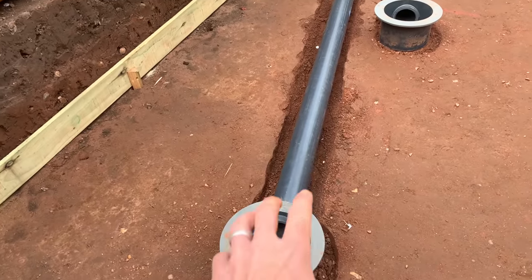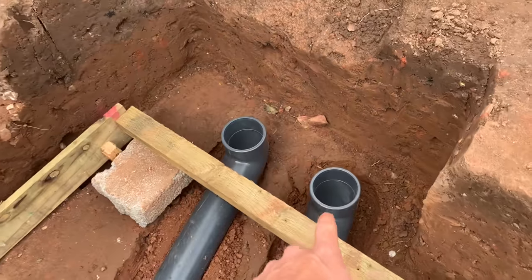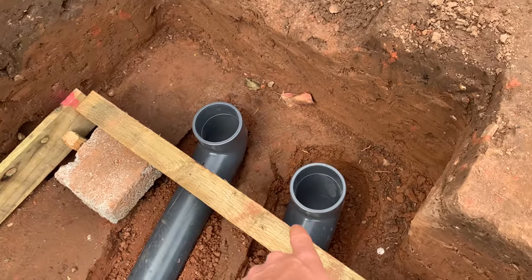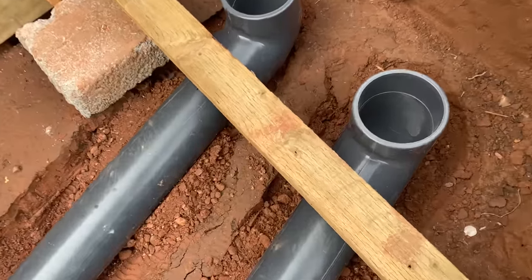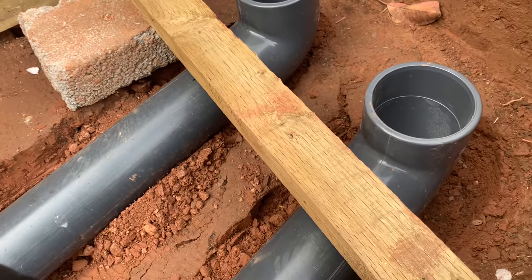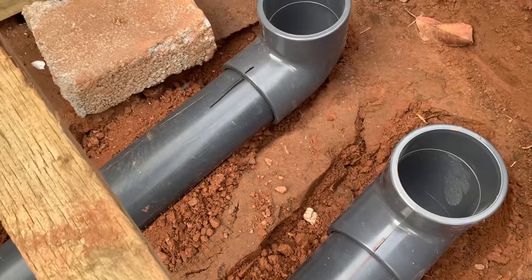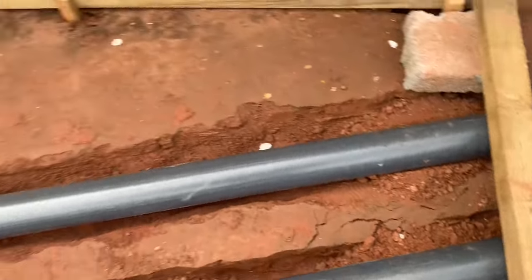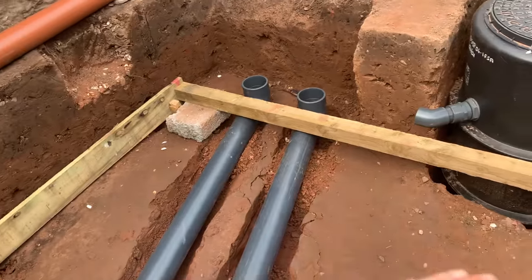So today this needs to be put in — I need to cut around the pipes, part cement this in, still got to fit the airline, and still got to glue up the ends. I've made sure I've left enough room so I can get a ball valve on the end. I do apologize about the wind today, it's just crazy. What I've done, I've measured this — in effect this will be my pond wall — and I've just put two marker lines so I know where to pop these pipes off, glue them up, and sit everything back in place. Making sure everything is level across there and equal distance.